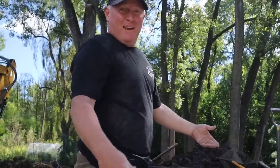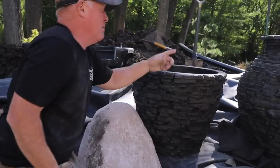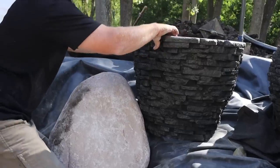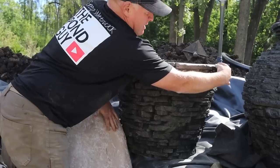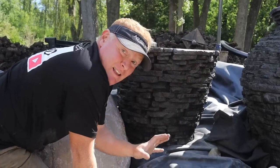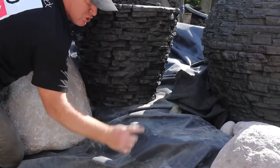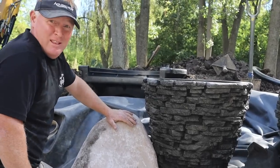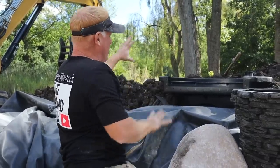We talked a little earlier about the customer adding an urn, and so many times we'll take an urn and break it up into different pieces because then we can get multiple features out of one. My plan is to get a little spillway that drops this way, then another one that drops almost back like this, and through here that drops this way. If I get lucky and the rock works with me, let this drop into a little pool back here and then do something with some boulders out here and let it drop again coming this way. This is all just our typical types of boulder waterfall - ripping, twisting, turning.